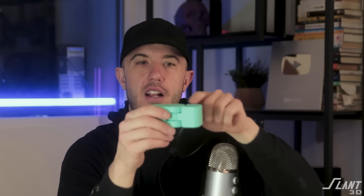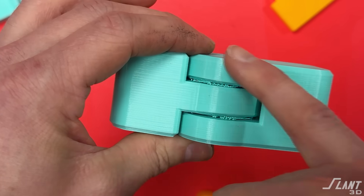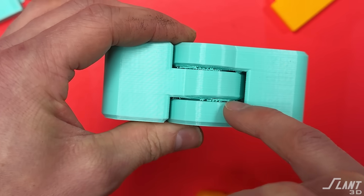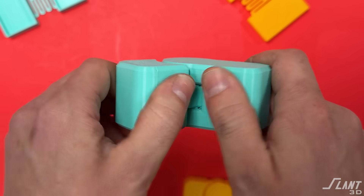The challenge with this type of hinge is that since it's not constrained the same way, the cone going up to the top is free. This one doesn't really have any overhangs that are an issue, but this double-cone one does have overhangs that can cause fusing inside the part. You can see the messiness here because the top loop has to settle onto the bottom loop — the material kind of falls down onto the other one, so one link of the hinge acts as support for the other link. This is not the end of the world but it's not very robust.